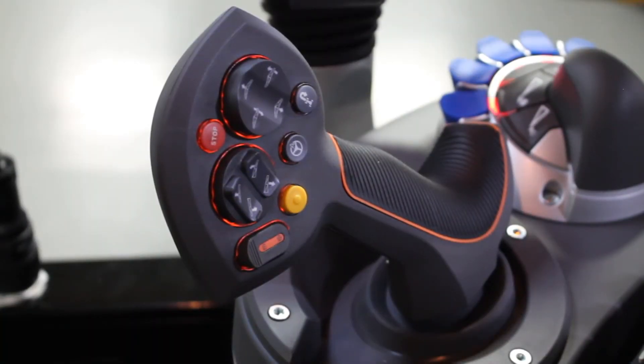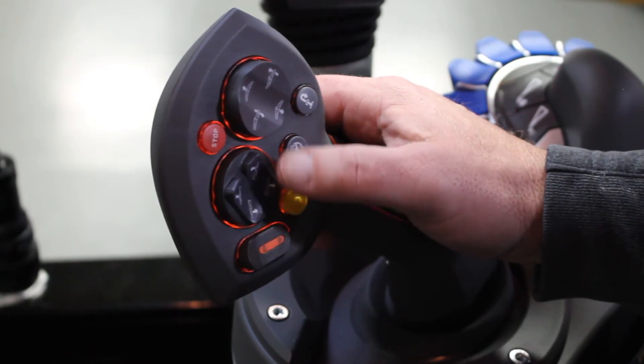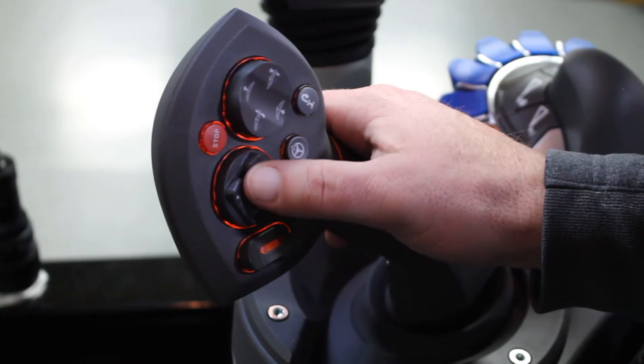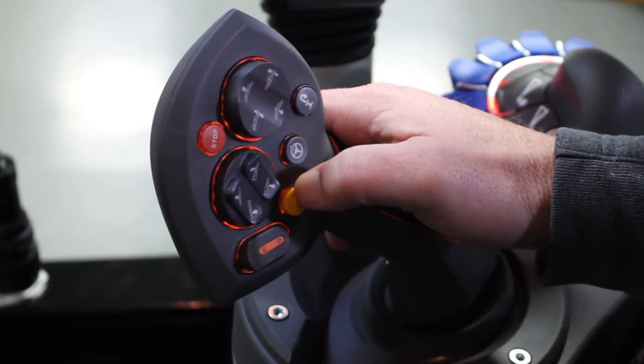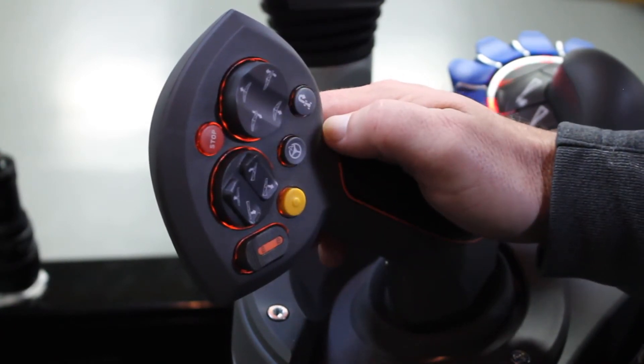Hello, I'm Paul Haefner, Application Equipment Product Specialist. For an Air Max, the controls found on the joystick will be my tilt functions for the booms. I can tilt up and tilt down, or if you go in the center, you'll be able to do them both up or both down at the same time. There is no main mast functionality on the Air Max.